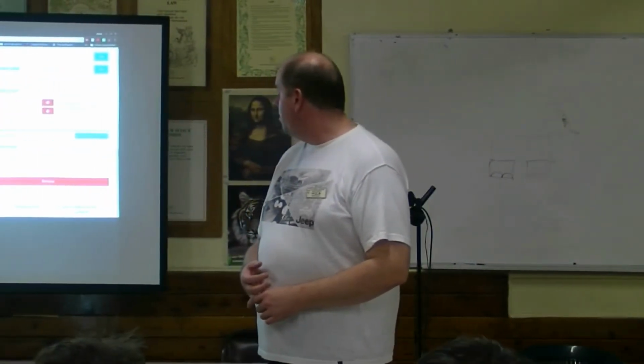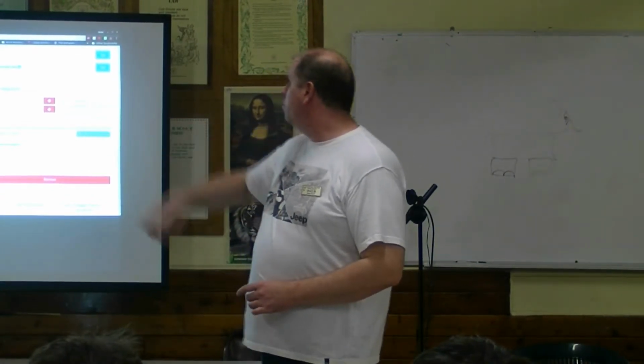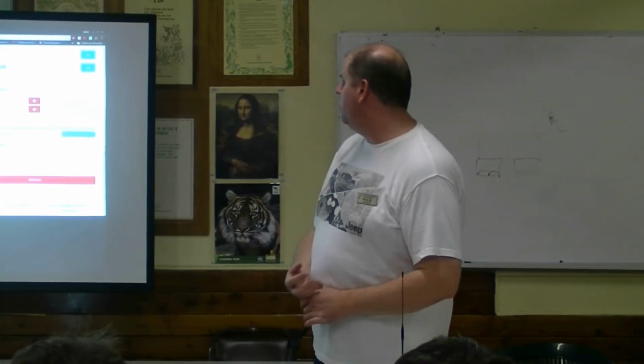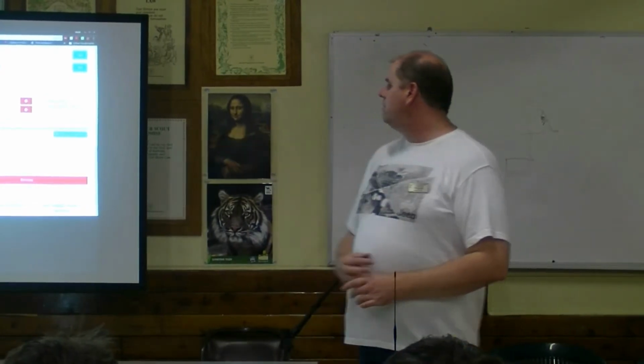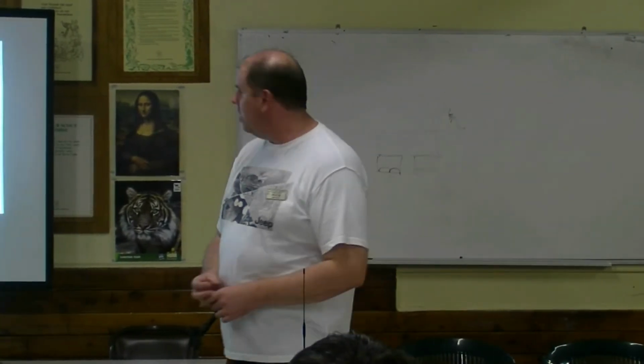Clusters, I haven't had much of a play with clusters. You can see the configurations for the two different talk groups there. Time slot 1 I've got set to Worldwide 91. Time slot 2 I've got set to 505, and it's actually 5052, which is New South Wales and Australia as a whole.